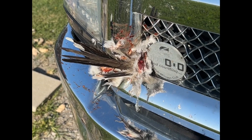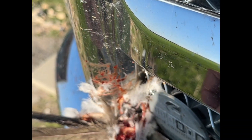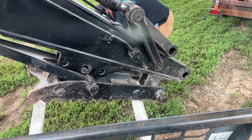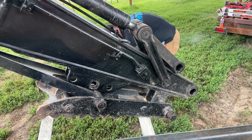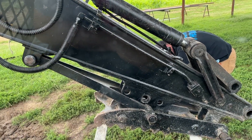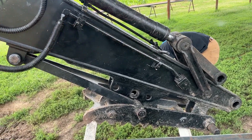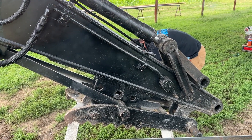We're having bird meat for breakfast today. Got us some bird legs. So right now we're taking off the mechanical thumb, driving this pin out, gonna get that pin right there out, and then the pin up there. Take that off and then we're gonna work on cutting off the linkages to put the new hydraulic thumb on.